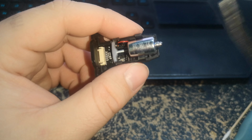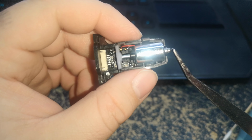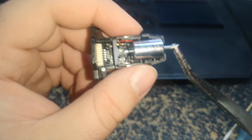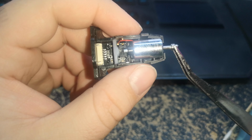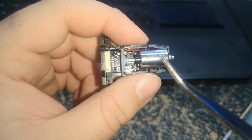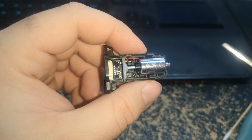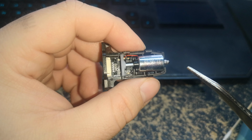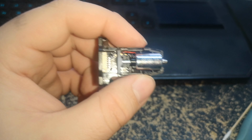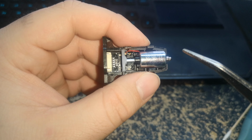Not the end of the world. It kind of sucks. It means I'll have to redesign my mount and everything. This one just drops in nicely. And I like the extra 2 millimeters of throw compared to the BL Touch. That's really nice for clearing stuff. It's actually better because all of my stuff is leveled up to the point where if I don't clean the nozzle tip off, it won't home properly. It'll fuck up, because the BL Touch doesn't have enough reach. This does. It's really nice. It's just the rattling that I can't stand. Can't stand it.